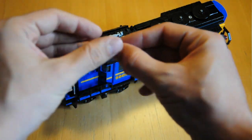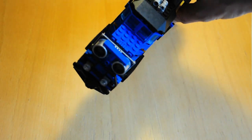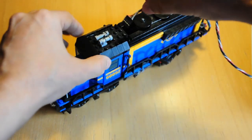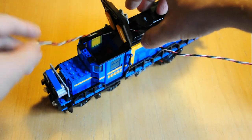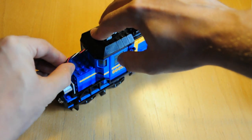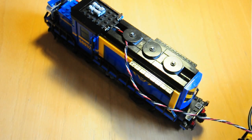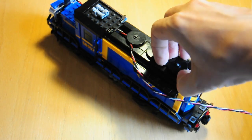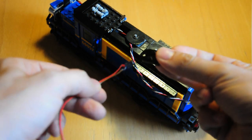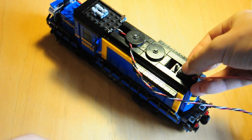A few bricks and a plate will hold that down in place. Each ultrasonic sensor needs two pins on our Arduino, plus power and ground, so I'm running four wires along the length of this locomotive. That's one set on the front, and I'll add one to the end of the train in a minute. I'll also run an infrared LED to the train's power function sensor so that the Arduino can send signals to the motor just like a normal power functions remote. Tutorial 11 covered how that works, but for now we'll just clip the infrared LED straight on top of the IR receiver.